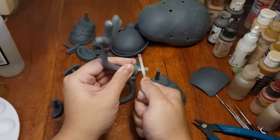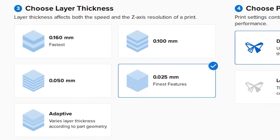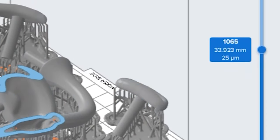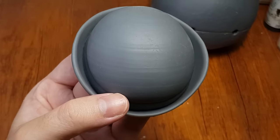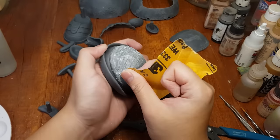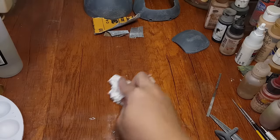Hence requiring a little more sanding to fit. Also there is a new beta setting called Adaptive, which is basically different layer thickness depending on the details of your 3D model. I foolishly tried it when printing all the other accessories, and that resulted in a very uneven layer for all of them — as you can see from the hat. We have no choice, we have to sand them all thoroughly.